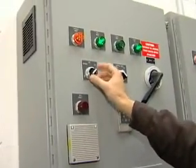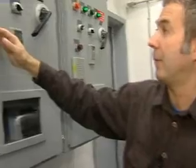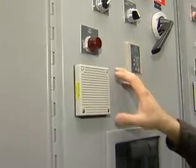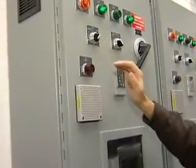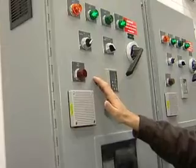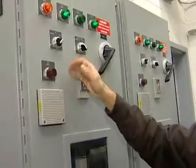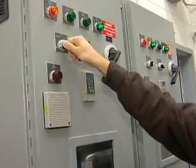Over here we have a VFD mode — off and bypass. You would only turn it off if you needed to work on something; otherwise it stays in VFD mode. VFD stands for variable frequency drive — it allows the fan to speed up and slow down. In the event that the VFD device itself fails, we get an alarm and it quits working, we have a bypass mode. In bypass mode, it turns the fan to full speed and runs continuously. If you had a failure and were overheating, you could switch to bypass mode temporarily for cooling. I'll demonstrate — when we go to bypass mode, we'll hear the fan ramp up to full speed.